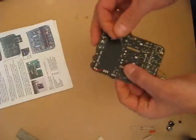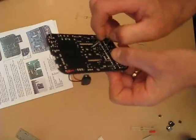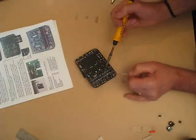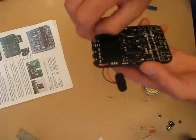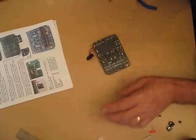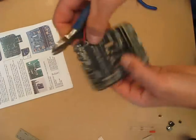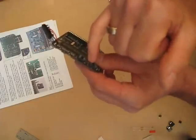Put the capacitors in — little capacitors that we're going to put across the chips' power lines. That will just smooth out any power spikes you get. Slide that one in — two capacitors in over the driver chips. Just trimming that wire right back so that those two wires there don't touch each other.